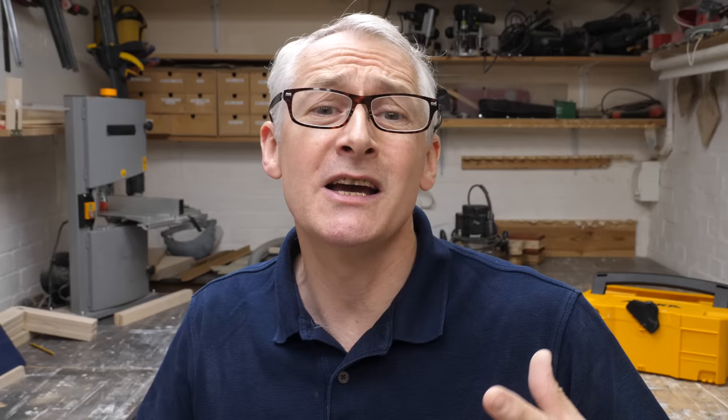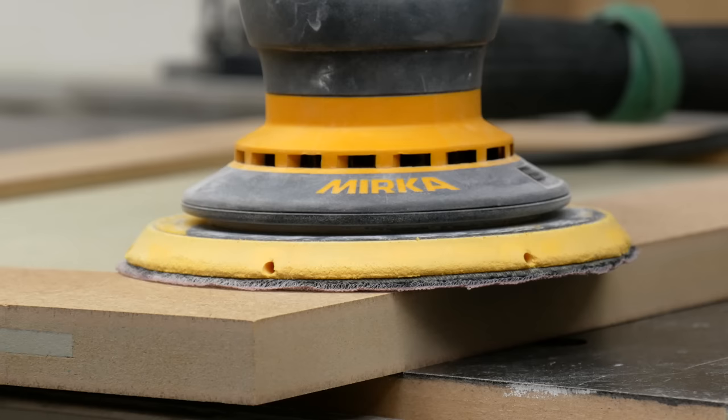I made a video about that. They certainly don't cause any issues with the motor on this sander from 2007 — same pair of brushes on this, by the way, and a total of only two new pads, so three pads in total. Also, the question that springs to mind is: if the backing pad is the cause of the speed controller failure, then why was this one returned to Leo with the original pad on it? That's like treating the symptom — the speed controller — but not curing the disease. Maybe it's different for brushless DC motors; I don't know, I'm no expert.